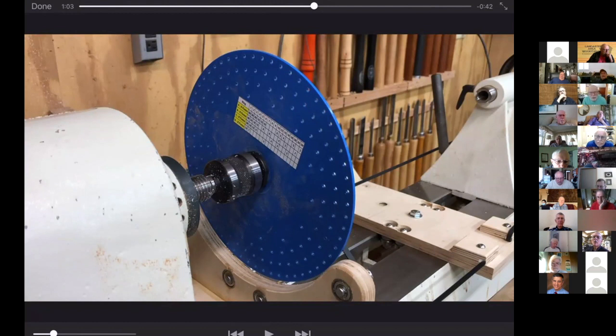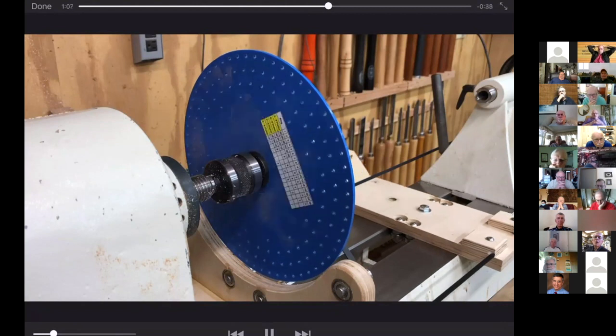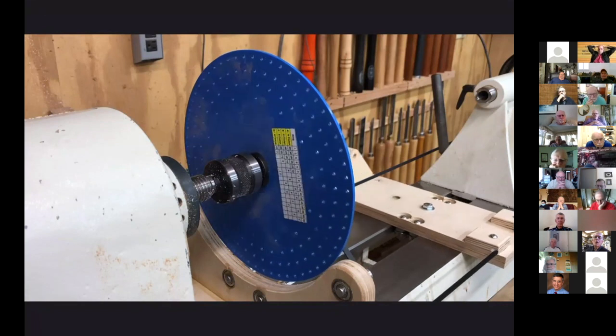Mine, because it's constantly engaged with the tapered pulleys, it takes quite a bit of load to rotate it when it's not under power. And so I went ahead and bought this PSI, Penn State Industries sells these live spindle pieces for, I think I paid $28 for it. So anyhow, that permits very easy rotation. And my invisible hand is rotating it down on the knob there.